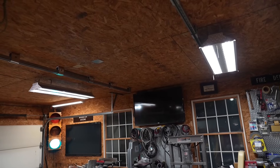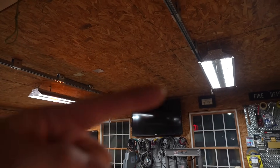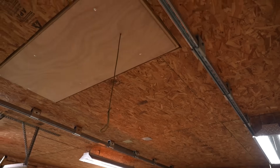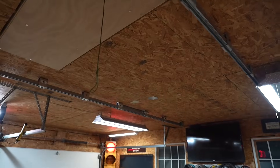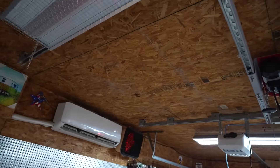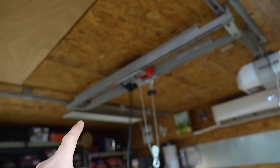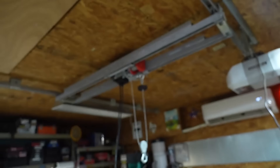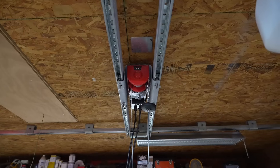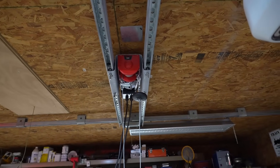With a little video editing magic, I'm going to show you the aftermath. Basically, we took the original rail and moved it about a foot and a half so it would clear the attic entrance. I mounted another rail on this side and both of those rails go all the way across the shop now. So instead of using an additional single unit track across the bottom — I was afraid it would hang too low — I decided to cradle it in between two more pieces of Unistrut. This allowed me to get the hoist a little closer to the ceiling so it's not hanging down so low.